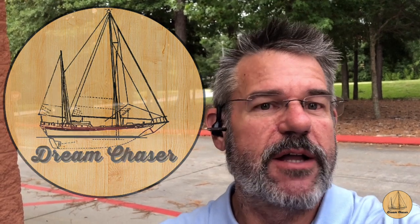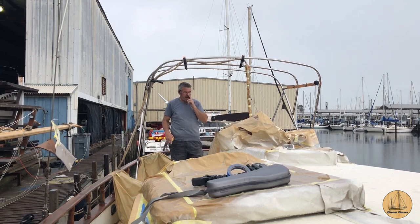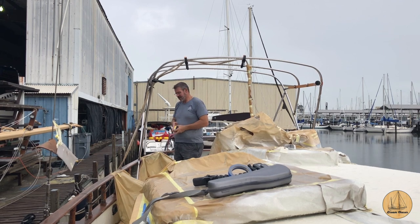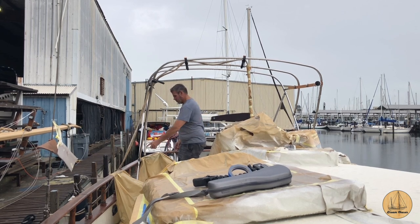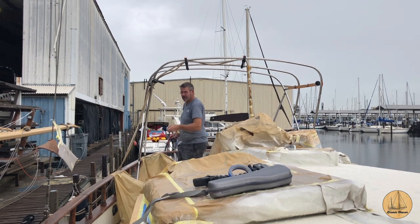So we talked to the fabricator, and he believes he can make stanchions and lifelines that are going to look very much along the same lines of the beauty of the boat. Just like before, I have to determine the number of stanchions to go around the back here. We sort of assumed it would be about 8. I think we might have to go 10. The challenge I'm going to have is we can curve the top rail, but the bottom lifeline, if we had one stanchion here and one in the back, would cut across that. We certainly don't want that, right?